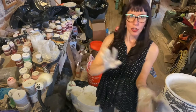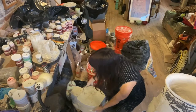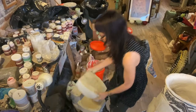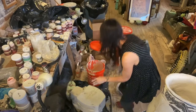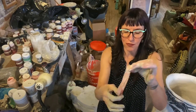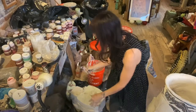You can make molds or you can purchase molds. I'm going to use two purchased molds here. Sometimes they can be complicated, but this one is a pretty simple mold — it's a two-piece mold. What you do is put it together just by using rubber bands. You can even use old tube tires — cut them and make these big rubber bands to put around the mold.